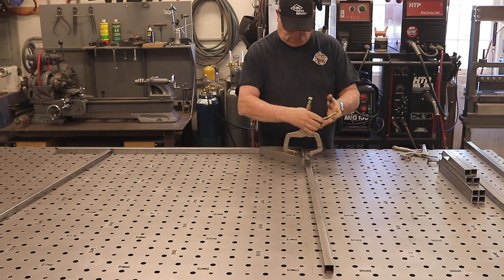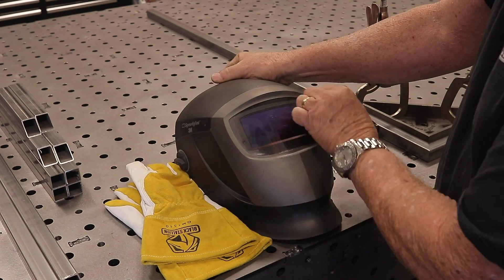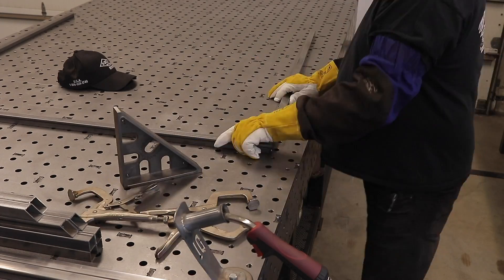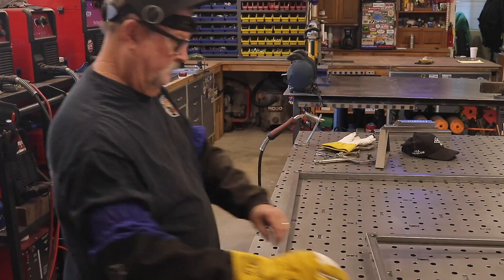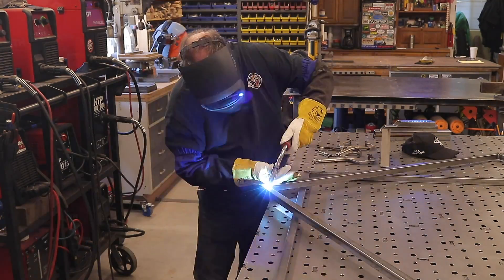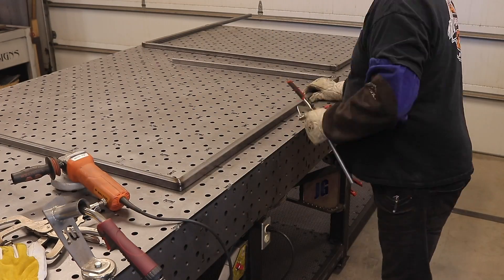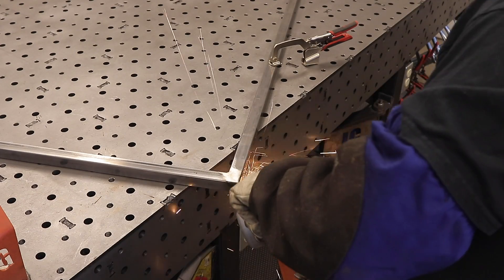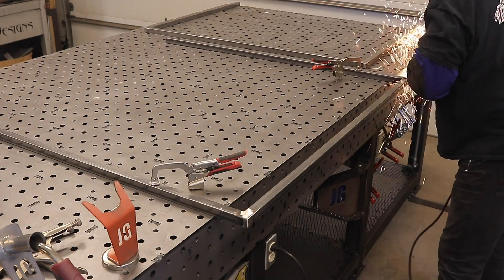Clamping things together with the Fireball square and getting the initial pieces put together. I'm using these Flents wiping clear lens wipes — I use these for my glasses and my hood, they work really good. They're really inexpensive; I got them on Amazon, I'll put a link in the description. A box of a hundred or two hundred is only about six dollars. I'm just getting the first primary pieces welded together. I like to weld everything together, then weld all the way through both sides, and grind those welds down so I have a completely flat surface to work with.